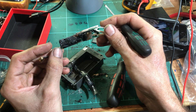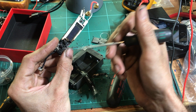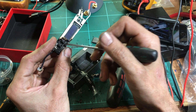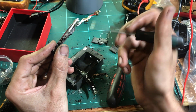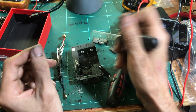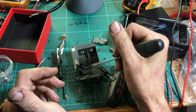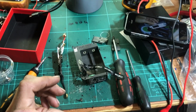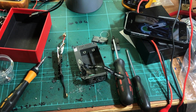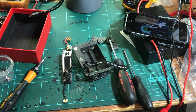If you're not using your drag and leaving it unattended, take the batteries out. That's good advice for any mod — anything you're leaving at home unattended, take the batteries out if you can. Just pop them out, leave them in a case or stored somewhere safely. Especially in this case, because if it happens, it's going to get nasty. So: juice damage worth having a look inside. If you know it's had a lot of juice inside, worth having a look and seeing if you can clean it — if it looks really bad, maybe retire the device. If it looks dry and you know it hasn't had any, up to you where you want to go with it. If you're going to continue to use it, take the batteries out, keep an eye on it, keep an eye on the forums as well. If we see them start popping up all over the place burnt like this, I'd start getting worried. We'll update you guys if I find out anything else. Cheers guys, see ya.